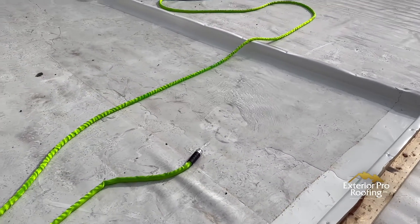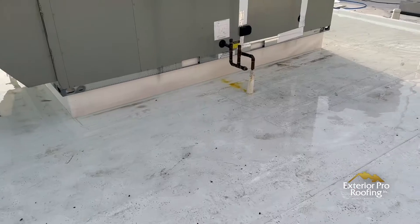One of the ways you can prove the roof is not leaking is to do a water test. It's not something I'd jump to first — I'd review video two in this series and walk through all the other steps, because they're less time-consuming. However, this water test is pretty conclusive. You isolate an area, fill it up with water, and just wait to see if the roof leaks.